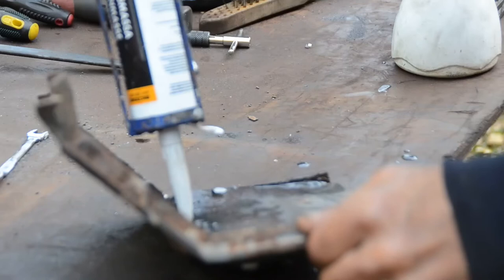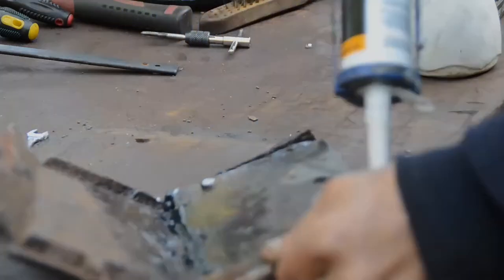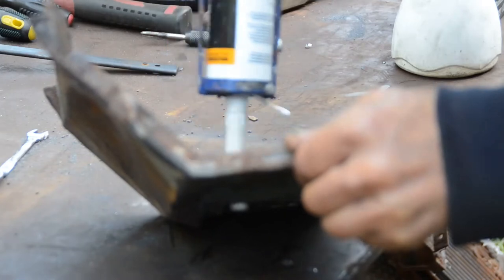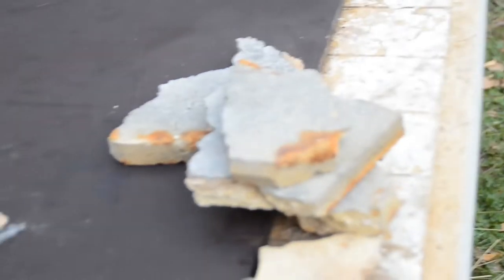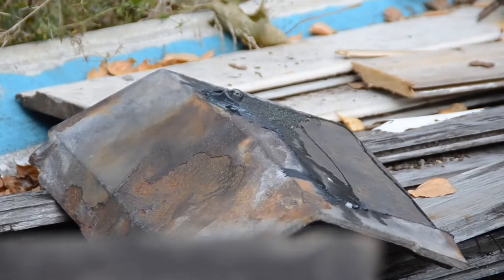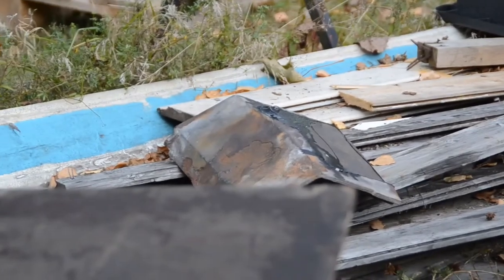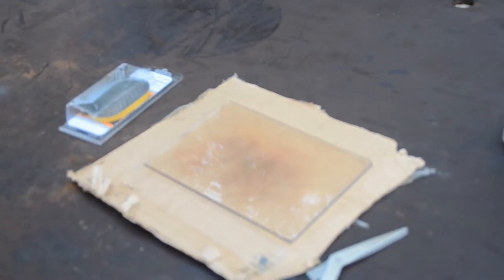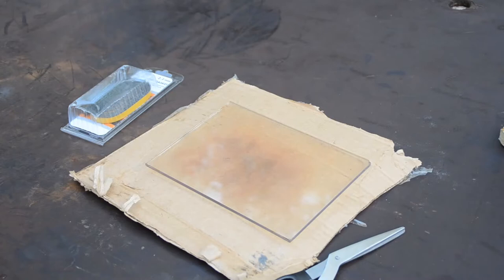So this is a very rough made repair. So tomorrow it's dry enough, and I mount it into the stove. So next step will be to mount in those stones on the one side, only the one side, so I can get in this plate here. This smoke guiding plate, which is laying there to dry. But next step will be trying to mount the glass on the door without taking out those screws.